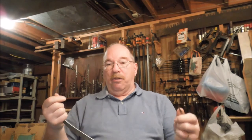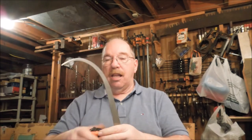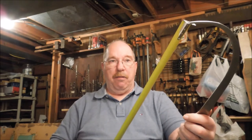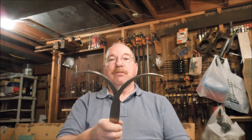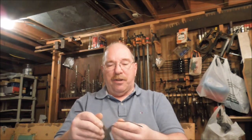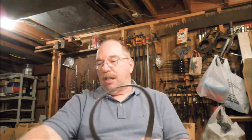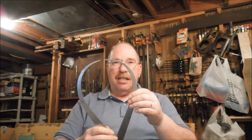On a straight bar I can go a lot further, because I could measure as far out as that. And that would let me measure out to twenty-one inches — that's pretty impressive. The other thing this does though, is because of the design it lets you measure inside measurements also. When you're cutting inside measurements like you're turning a bowl, it's also handy because it has a great deal of reach to it. It'll let you reach down into a bowl with a half inch wall thickness — you can go down into that bowl ten inches and measure the thickness of the bowl wall at a depth of ten inches. That's handy when you're turning.